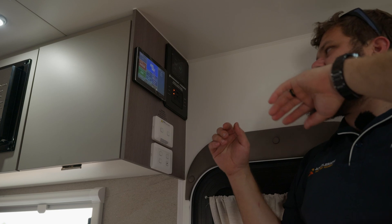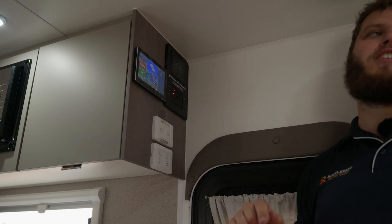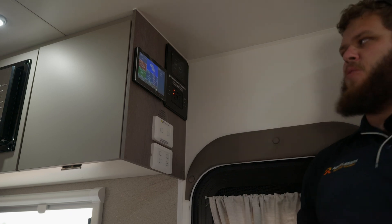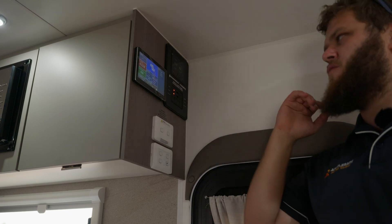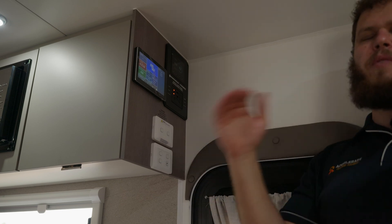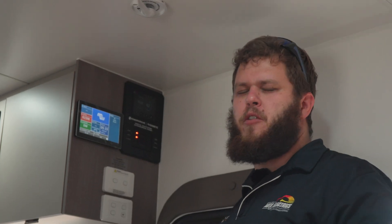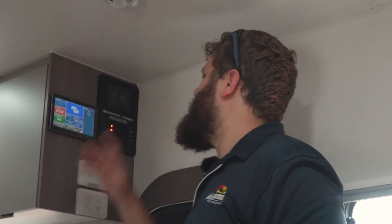Now that I've explained all of these systems, you're probably thinking: why the hell do we need so much? Obviously part of it is customer requests, but it's really awesome. Essentially, Victron is monitoring all of the charging and discharging side of things, so you can see exactly where your power is coming from and how well the system is performing. Simarine is essentially for monitoring all of your loads - anything coming off of the batteries - as well as water tanks, temperatures, and things like that. Both are able to be monitored remotely. And then we have the Garmin power switch, which is separately doing all of the switching aspects of the system.